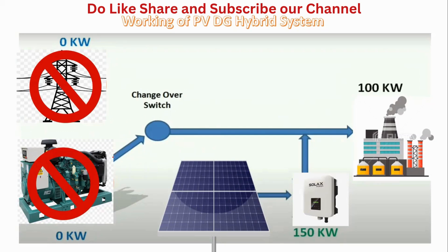As per requirements when purchasing a generator, a minimum of 30% of the load must be given to the generator based on the kVA size purchased from the manufacturer. If this 30% minimum load requirement is not met, it will have various negative impacts on the generator — improper power production, higher fuel consumption, and overall system collapse due to dry running. That is why proper synchronization is required in a PVDG hybrid system.